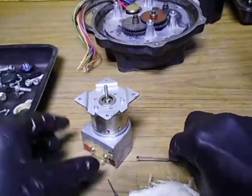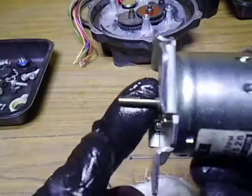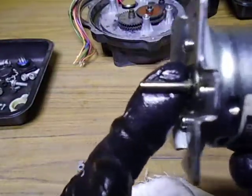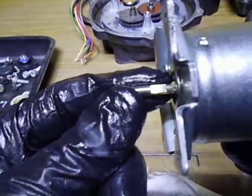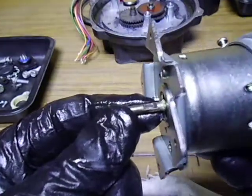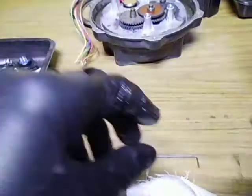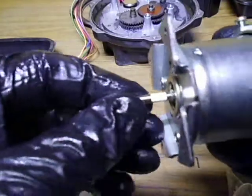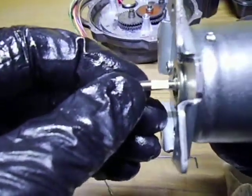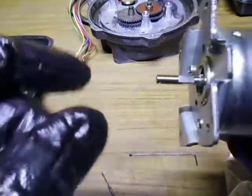As you can see when we pick up the motor, there's a cutaway - put your finger behind that one and you can probably see it better. See the square cutaway in there. And actually when you look into there, you can see where it's been sliding up and down. I dare say it's probably got a bit of a mark up there too where it used to be - there's a slight elongation of the hole there, well not so much a dent but a mark. That's identified that little issue.